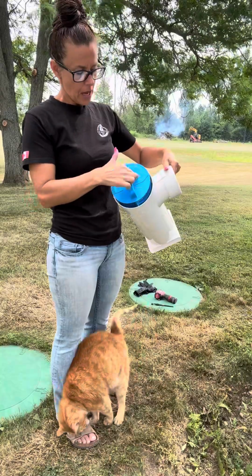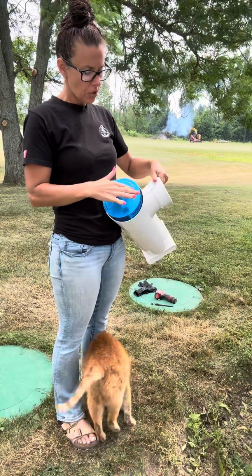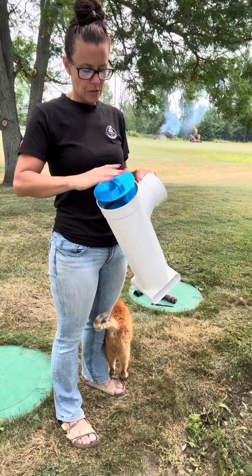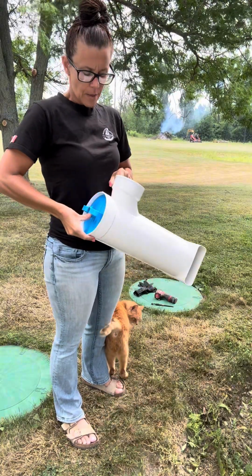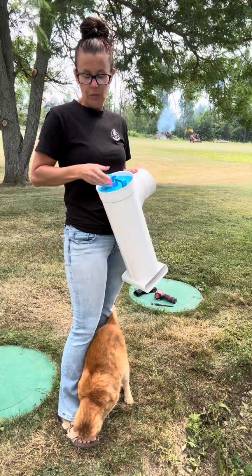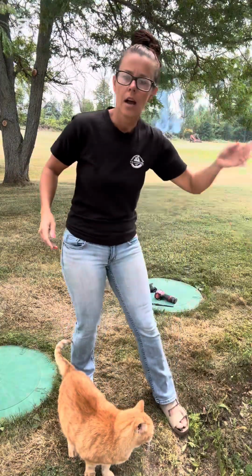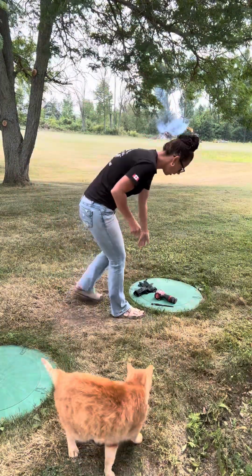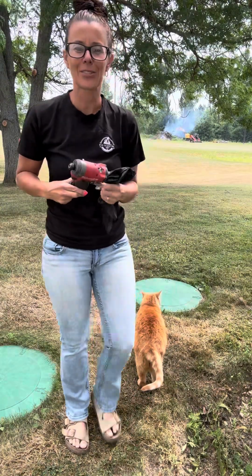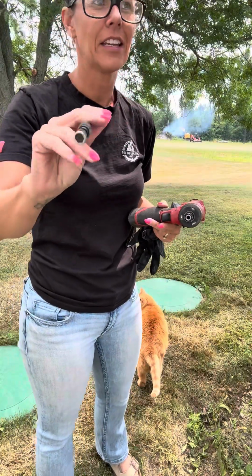There is a little arrow on the top of this particular one that says outlet. You want the arrow pointing in the direction of the pipe to make sure it's in the correct way. All I'm going to do is take ours out from underneath the lid, give it a rinse off with the hose, and put it back in. Quite simple. I'm going to put on my gloves, up to you as to what you want to do, and then I have my hex head ready to complete undoing the lid.